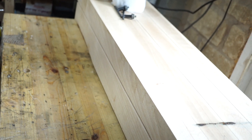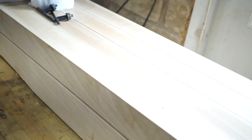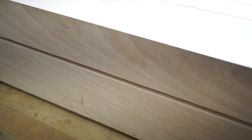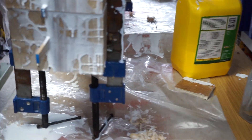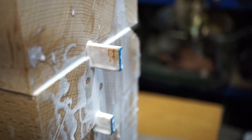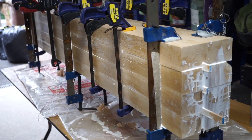So this is the first slab glued up and out of the clamps — I forgot to film it, and I also forgot to film the second slab. The grooves I cut earlier on the router table are these grooves here all the way along, and they're basically going to be used like long biscuits or dominoes which help for alignment. Moving over to the slab that's currently gluing up, you can see that there are long thin strips of wood — battens effectively — that have been slid into those grooves to help with locating, and that's the second slab all glued up.